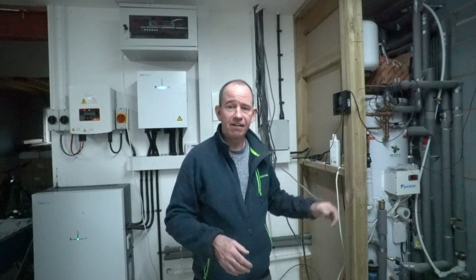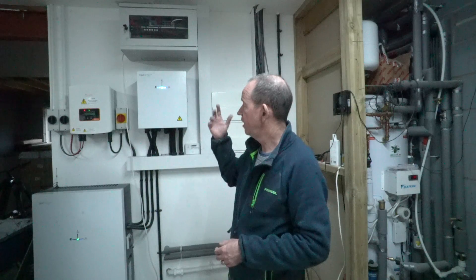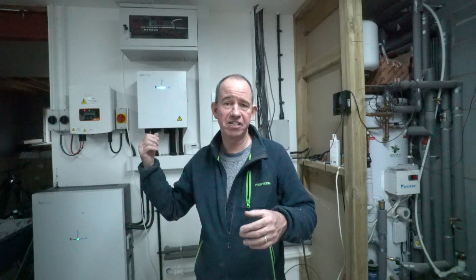Finally on the installation in the garage is the networking. I've got a 24-port patch panel here — my son did a great job installing it. It's a nice modular patch panel that allows you to fit Cat6 and other connectors like USB and HDMI, and move those around — for example, keeping all PoE cameras at one end. I went for a small cabinet to look neat on the wall, but I found some devices I was considering, like the Ubiquiti USG Pro, are deeper than the cabinet can accommodate. That may mean I need to change to a deeper cabinet later, but the good thing is all those patch panel connectors can loop out the back without re-terminating everything.